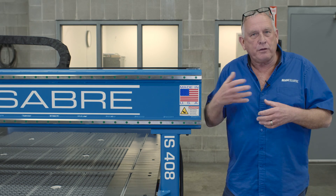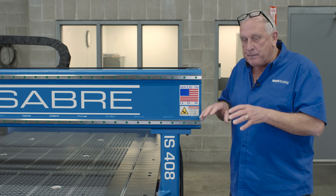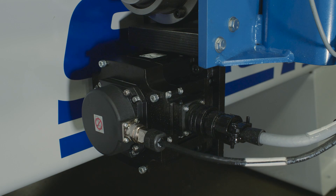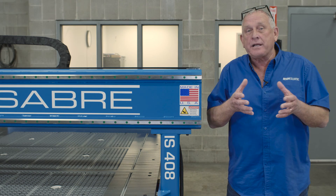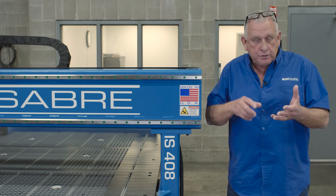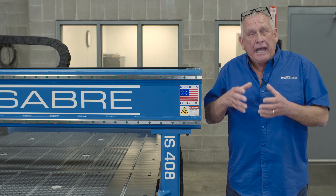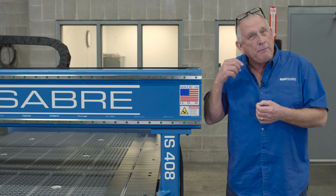The final mechanical part of machine motion is the drive motors themselves. We use Mitsubishi closed-loop AC digital servos. Our concept was to create a machine-tool-grade CNC router, so it has to be really accurate and really powerful to produce high cutting speeds — you just can't do that with steppers or low-end servos. On top of that, we also put glass encoders in there. Those feed back to the machine control very, very fast, which makes the machine more accurate.